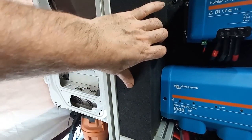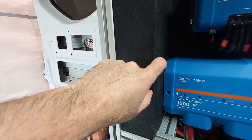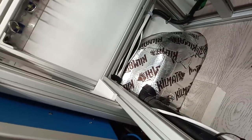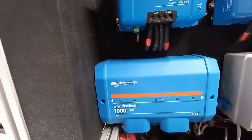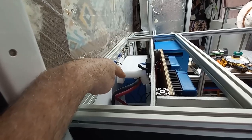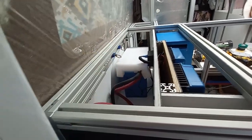All the pieces with exposed connectors I've hidden inside this box. The shunt has the negative, and the chassis ground also runs out from the shunt over to the wheel well — there's a nut at the bottom that's the chassis ground. The shunt measures incoming and outgoing current, and that's how we determine how much power we have left in the batteries. This will be the main battery disconnect, and the batteries will be in this tray — there's one right now but eventually there will be three.